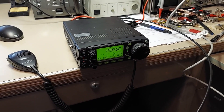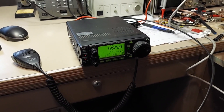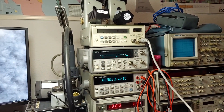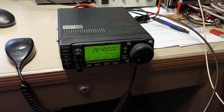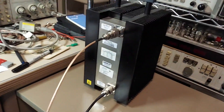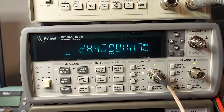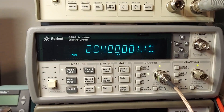So let's try doing a frequency stability test. We'll key the radio down at 25 to 30 watts for three minutes and use my Agilent 53131A that I got from a hamfest. We'll do an Allan deviation plot to see how well it holds frequency at 30 watts. For this test, I'm going to transmit at 28.4 MHz using 25 watts key-down power, running into the BIRD 40 dB attenuator. My last key-up, I saw 28.4 on the frequency counter — so it is within a few hundred millihertz. About a hertz high right now and going upward. Not bad at all.